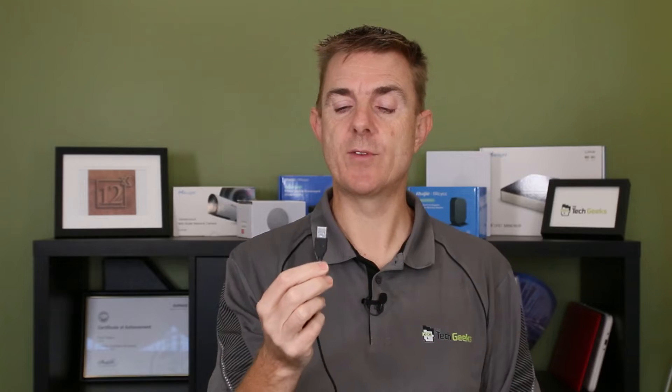You are also going to get a mouse. This is a full NVR so it actually has a video output and you can connect it directly to a monitor if you want. It's just a USB mouse — nothing clever there. You can control this using a web browser, the app, or your mobile app, but you can also wire this up for simultaneous output. I think you can do 4 simultaneous video streams at a time.